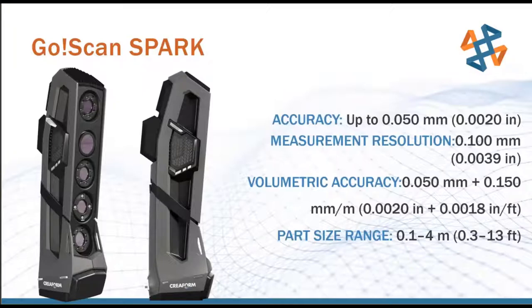It's the same thing here. High resolution scans, we can see all sorts of very fine features. Low resolution scans, we can't see those fine features quite as well, at the benefit of we don't have as much data in the scan. So it's trade-offs. You can have very high accuracy scans with very low resolution and vice versa. So these are two independent factors that are spec'd out on all the scanning equipment to keep in mind.